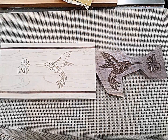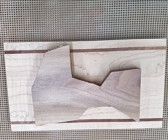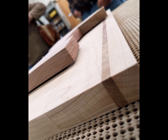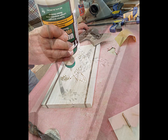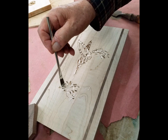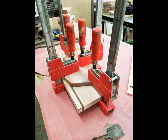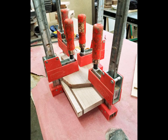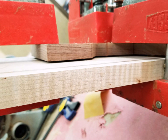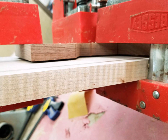Before applying glue we lay the male inlay next to the female pocket and flip it over to see if it fits. If we did everything right it should settle right in with a nice snapping sound — it's a good feeling when that happens. There should be a space between the two pieces when they are placed in position. Now it's time to do the glue-up. We apply glue to both pieces making sure all the mating surfaces have glue on them, using glue brushes to get into all the nooks and crannies. With glue applied we put as many clamps on as possible. It's important to keep the top piece parallel to the bottom piece and to apply clamping pressure evenly. We like to use parallel clamps. The glue needs to dry at least an hour or two, but we usually leave the workpieces in the clamps overnight just to be safe.